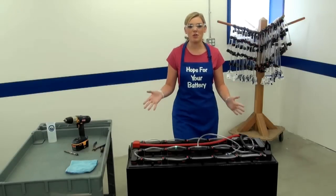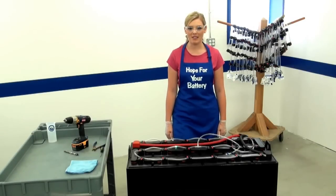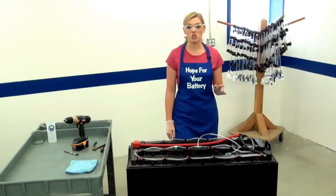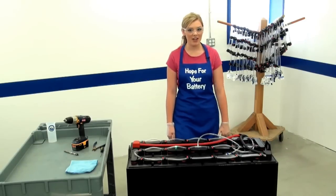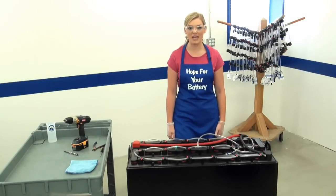The sensor is now fully installed. A few notes on the working mechanism of the sensor: the sensor light is very bright and lets you know when you need to water the batteries. If the light turns solid red, you need to add water to the batteries. If the light is green, the electrolyte levels are good. The iLight sensor also has a unique feature: if the light blinks red, it's letting you know that the electrolyte level has been below the probe for more than 10 days.